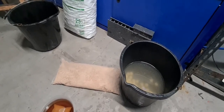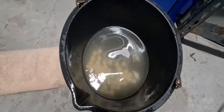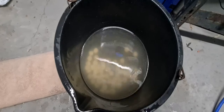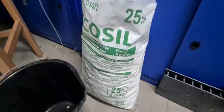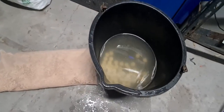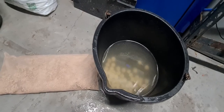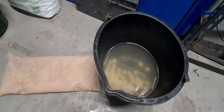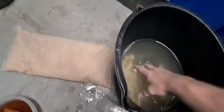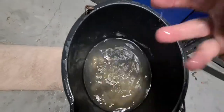We've got here a bucket with normal lukewarm tap water and we put in 700 grams of salt tablets — just normal softening salt tablets which we buy in the big sack. Normal table salt works fine if you've got a one kilogram bag at home, or you can buy dishwasher softening salts, which are exactly the same. Table salt, dishwasher softening salt, or standard softening salt tablets — they're nothing special, just salt compressed into tablet form.